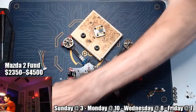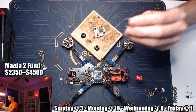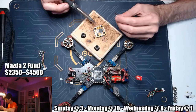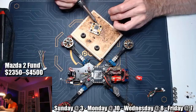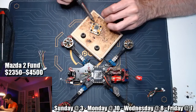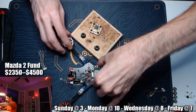Let's do some tinning. So we're going to start with this camera signal pad here. Come on, get off of there. All right, camera signal pad first. And then I'm going to skip those. We're going to go three pads over here, the one right next to it. That is video out and smart audio. And then we've got a 5-volt pad and a ground pad that we're going to power that microphone off of. And then we're also going to use these four pads. So that is kind of it in terms of the pads that we're going to be needing to have soldered.